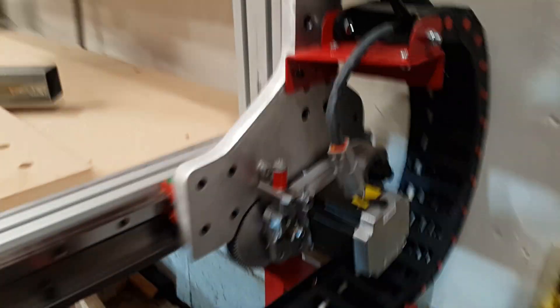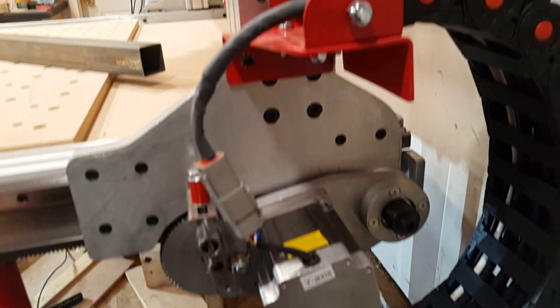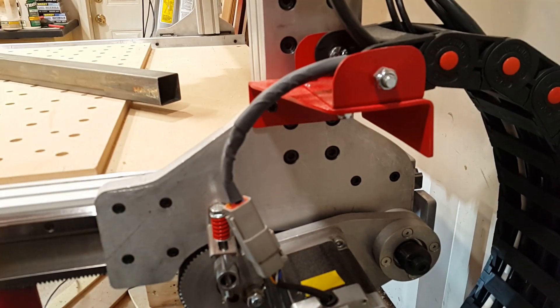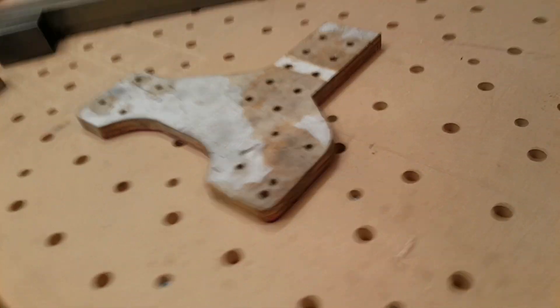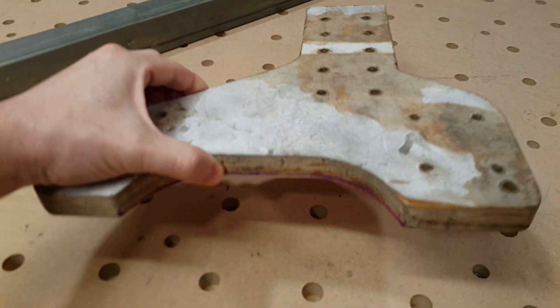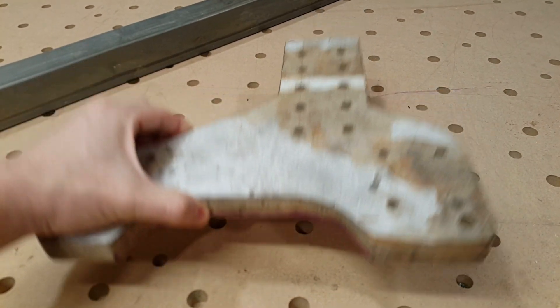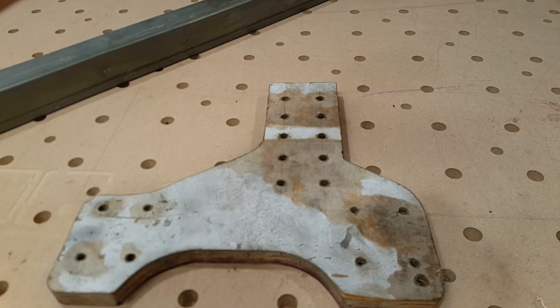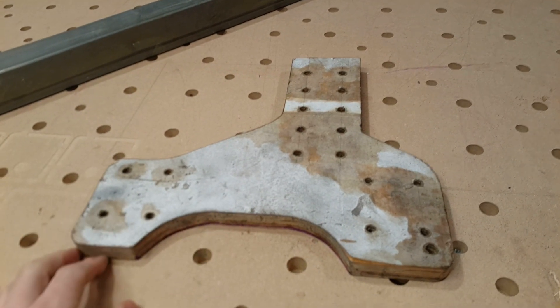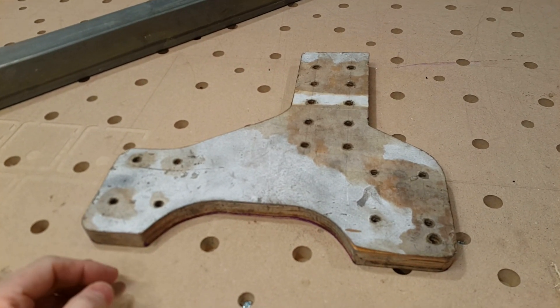As you can see, making this plate accurate to 90 degrees really helps. I was able to drill both plates simultaneously — I made a jig and then drilled through essentially both plates at the same time so that they're exactly the same, even if they're not perfectly square. I think they're pretty close based on my tramming efforts.